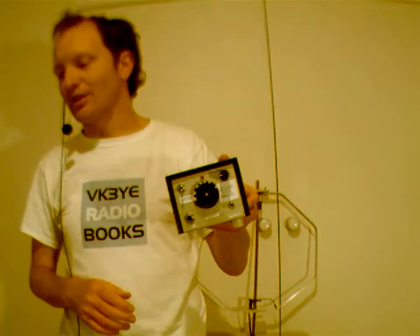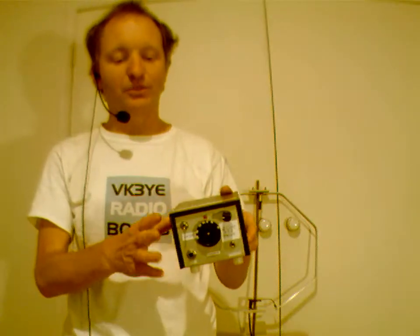Another thing is you can build your own from scratch. I'll show you one in a moment. Okay, this is an example. It's a 40-meter double sideband transceiver, which I've called the Beach 40. If you're looking at transceivers to build, unless it's strictly as a construction project, I'd suggest using frequencies and bands that you're likely to get a contact. And it's also easy to build gear for. 3.5 or especially 7 megahertz are very good. CW, double sideband, now consider the option of a digital modes transceiver project.